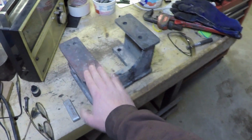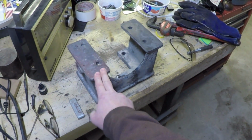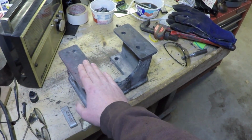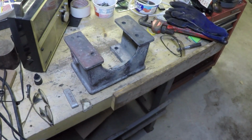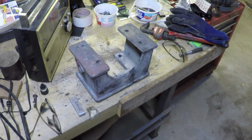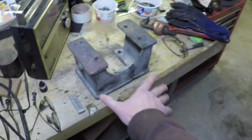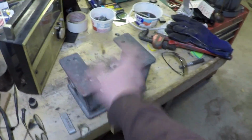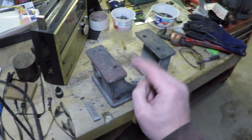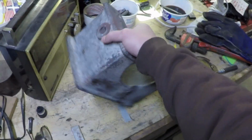So the reason why I talk about there being two surfaces here is because maybe I can mill out the high spot on just one of these two surfaces. I don't know about that either. I could probably do that. If I clean up the bead and that sits that way on the plate, no problem, then yeah, that's a no-brainer. We just clean up that one. I also have to take into account that milling off any of this material is going to shorten this leg.